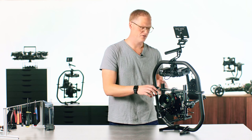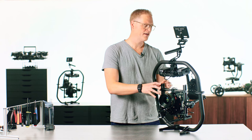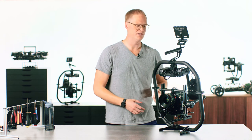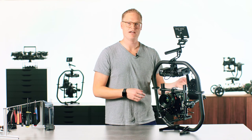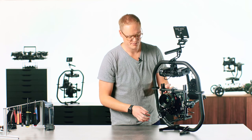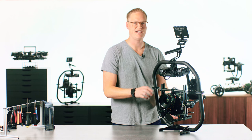If you're not getting a good tune with Auto-Tune, I have a troubleshooting workflow that I engage in. The first thing I look for is anything on the gimbal loose. If anything's loose and can resonate, that will screw up Auto-Tuning. You want to make sure everything's locked down — I just start pushing on things and making sure everything's tight and rigid.